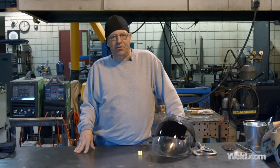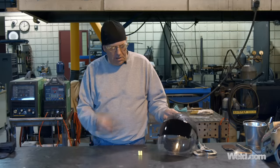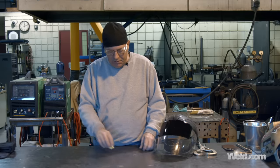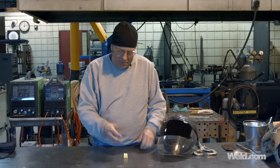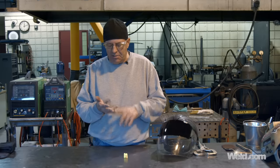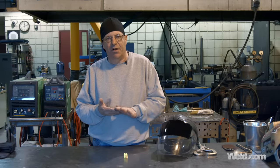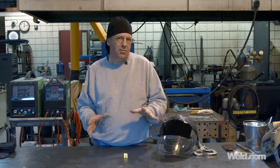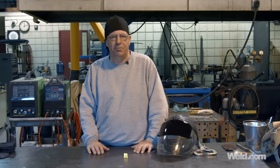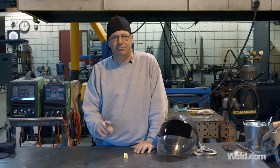That's a good demonstration on how to properly clean material — proper tools, proper safety gear, eyeglasses with side shields, ear plugs if you need them. We need to do everything possible to get a good clean weld: take the mill scale off, take the oxide layer off aluminum, take the rust off carbon steel. I hope this helps. In part two, we're going to weld over some of the bad parts and some of the clean parts, so stay tuned for that.